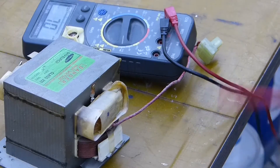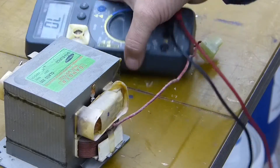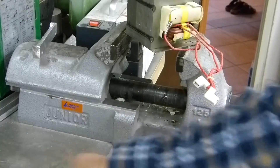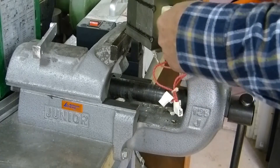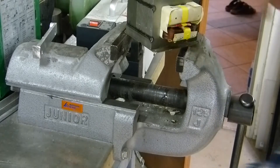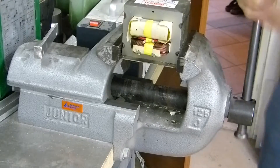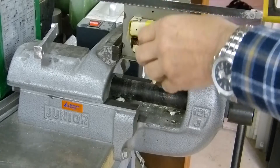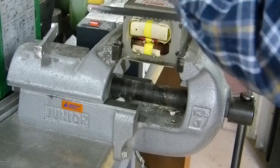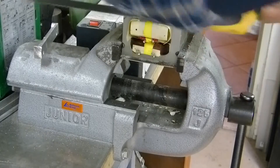It's always a good idea to test the parts before you build something, so I tested the primary coil and it seemed to be pretty okay. As this is a transformer for microwaves, it takes 220 volts and steps up to several thousand volts. We need it to work exactly the opposite way, so we remove the secondary coil — I'm using a hacksaw there — and then replace the secondary coil with very thick wire, only two windings, to get a low voltage but high current output.